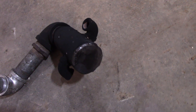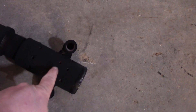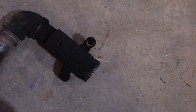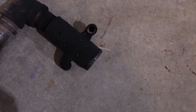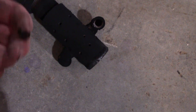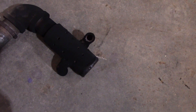I don't care to ever get sick from galvanized metal again — you do it once and you learn not to do it again. I was young and didn't know about galvanizing and found out the hard way. I think I just need a few more holes — these seem to have burned most of it, this one burned a little bit. I'm going to go around and add a few more. The swirl itself isn't what does the burn; it's the turbulence where it mixes with the air. I had a real smooth swirl in this oil burner before and got a really crappy burn. You have to introduce some sort of mixing turbulence — the swirl helps, but having straight jets with the swirl drives oil vapor into the oxygen and burns it.